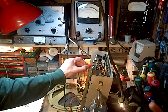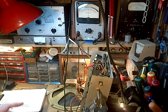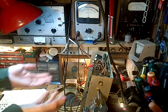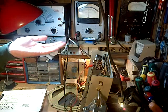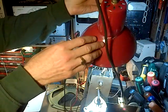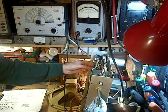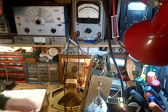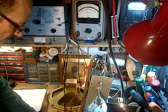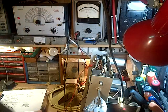Probably if they're set way out, you're introducing more tuned circuits. If you have a lot of trouble in the other tuned circuits, maybe they're going to prevent this test. So you're injecting the signal ahead of a number of tuned circuits and then working your way back to the antenna, fixing each tuned circuit as you go. But this radio already works, so I already know the signal comes through. Noisy. Signal, so we're ready to do this next step.